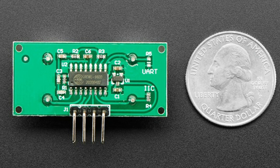Now I'll say one thing about it. It's not super happy I2C. It absolutely does work. It doesn't like to share the I2C bus with other devices, or at least when I put an OLED on the same bus, it kind of locked up the bus. But as long as I kept it as the only item on the I2C bus, it definitely worked just fine. And you might be wondering, what's the point of doing it if it's I2C and you can't really share it with other devices?